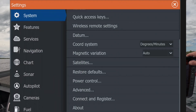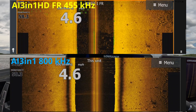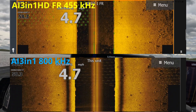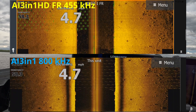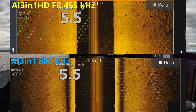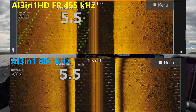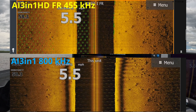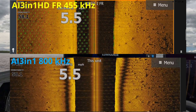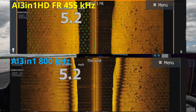Now let's go back to our screens. You notice there's a lot of noise on that side imaging — see it? And it's all coming from the left side of that transducer. That's coming because I turned the ping sync off. Again, we're running two different frequencies.